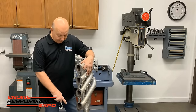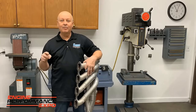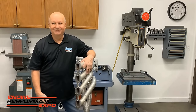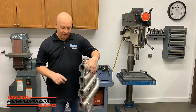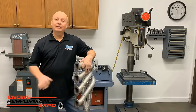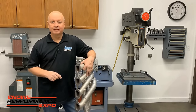Everything that's in that header goes all the way back in the engine, goes up and down with the rings, it goes up into the intake manifold. If it's got a carburetor on, it'll be on the underside of the throttle plates. Okay? A lot of people don't know this, but believe me, it happens. If you had mild steel headers and you crank the motor up, just chug it to life, turn it off, take the carburetor off, you'll see rust in the manifold.